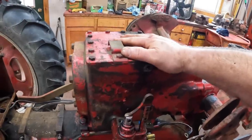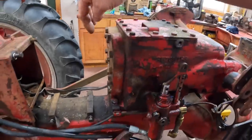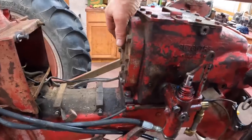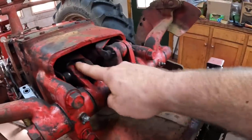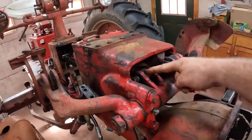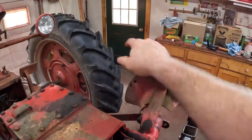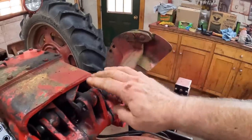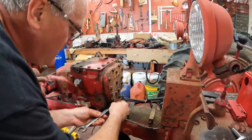The touch control is basically hydraulic valve controls and hydraulic cylinders all in one block. If you take the back plate off, there's a whole bunch of little check valves, O-rings, springs, all that kind of stuff. You can rebuild these — they're not too hard to rebuild. This one works great, so I'm not going to rebuild it. In the front, you've got two hydraulic cylinders, one here and one here. This one just drives the inside one that's used to control the fast hitch. A bunch of people asked me to take this apart and rebuild it, but it works great.